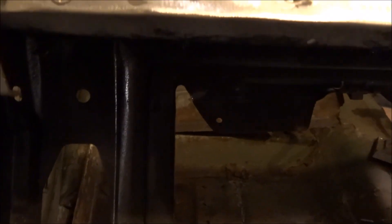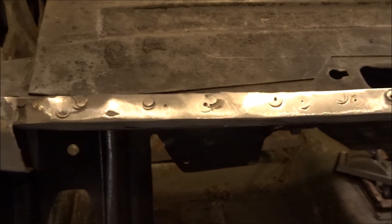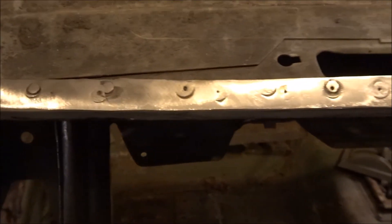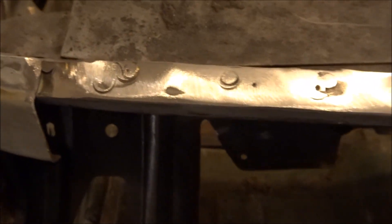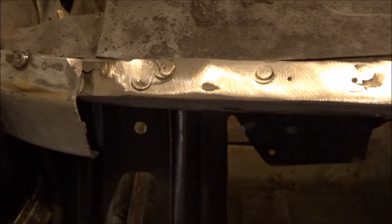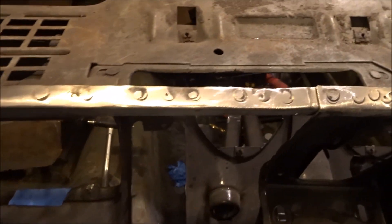As you can see, it's nice clean metal. I should note — I discussed in a previous episode how my welder had the wrong polarity, and bad on me for not checking. But it's interesting: when I was cleaning these welds up, some of them just literally popped right off the metal like there was no fusion whatsoever. It goes to show that no matter how high the heat setting, you're really not going to get a strong weld — it probably wouldn't have held in high-torque situations, and since this is a Mustang, all these pieces are structural.